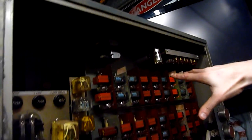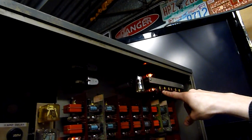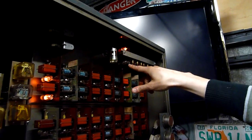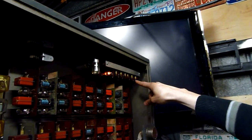So how does it work? I'm running it in auto mode at the moment. This is your clock, but basically you do that these days with a 555 timer, just set it as astable, and each time this pulses it increments this row of counters by one — one, two, three, four, five, six, seven, eight, and so on.